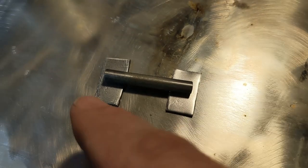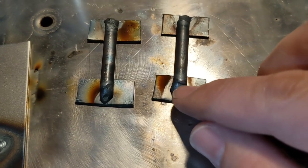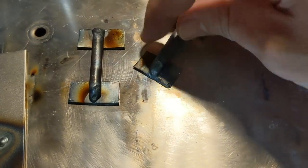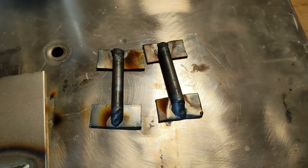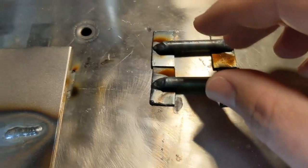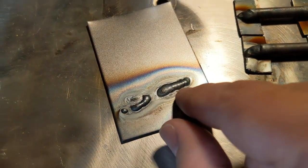What I'm trying to do is weld that little piece of bar to the two plates so that the bar has a pressure pad on either end of it. This ugliness is what I've come up with - I didn't even use any filler rod. I just used the setting for sixteenth-inch sheet metal and held the arc onto the wire until the wire turned molten and fused itself to the sheet metal. You can see I didn't dwell long enough, and after a while it was cooling down so I got some rust marks - I'll have to clean those off before I paint it. Terribly ugly, but it'll do the job. This is literally my very first arcs ever struck with my new machine, on regular mild steel.